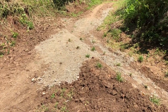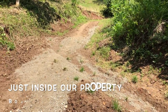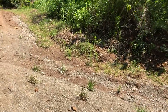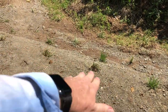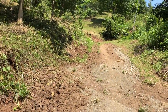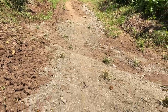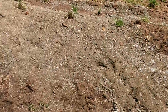Okay so here's our lowest drain so far. We may do another two further down, but for the moment this is the lowest and it's just above our property boundary. So we've got a reasonable slope here — this was the one where I showed the guys using the barrel, the metal digger, to take off this and get more slope on it so it's not as jarring on the vehicles, and then extend it further. Now this could be done a bit bigger but I don't think we need it here. This isn't going to pick up a huge amount of water — maybe coming from up there, a little bit from here, so it's not a major one. This one was flowing really well the other night when it rained. So they put gravel on top from the river. I'm hoping the grass will grow back over that section. And this is really quite firm now, almost like concrete. I think this is going to be quite stable.